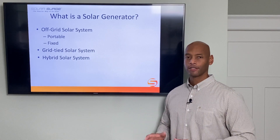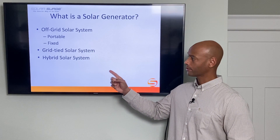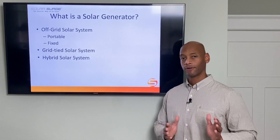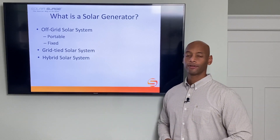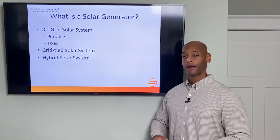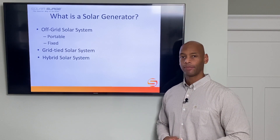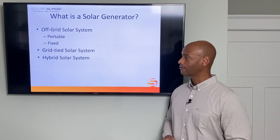The second type — and this is actually the most popular type of solar for homes here in America — is what's called the grid-tied solar system. With a grid-tied system, you have solar panels and an inverter, converting power from the panels into usable alternating current that can power the home or be sold back to the power company. The nice thing is that it doesn't require you to have your own battery bank, which helps save on cost and maximizes your dollar-for-dollar payback.